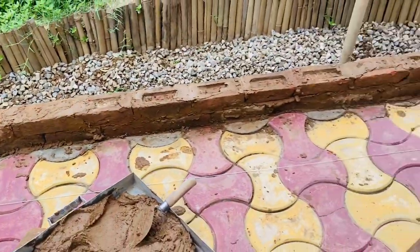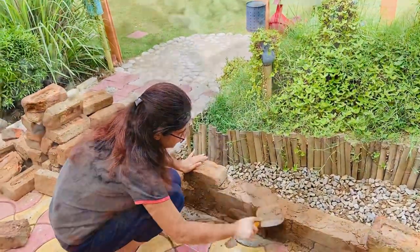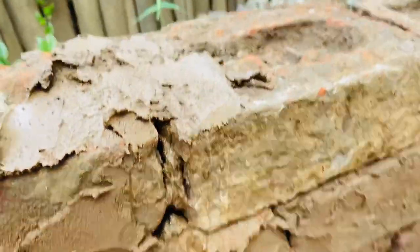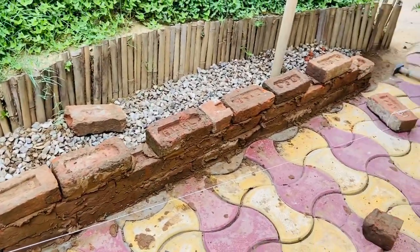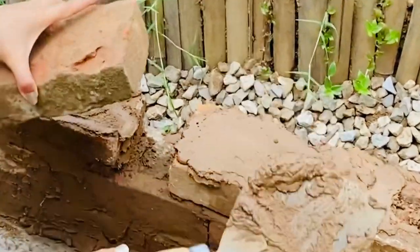Keep filling the mortar and laying the layers up to two brick levels. According to the design, in the third layer we need to keep a half-brick wide opening or niche — one in the center and two at the sides. Accordingly, place the bricks at the opening first and then complete the layer.